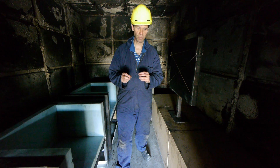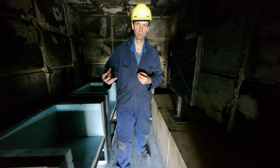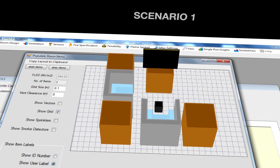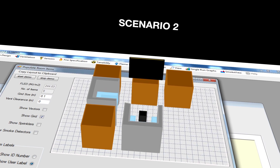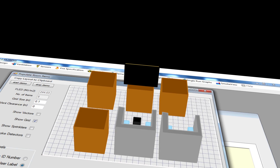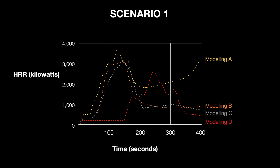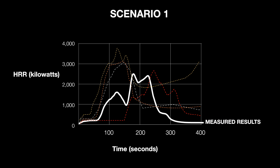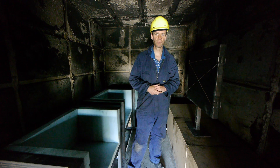We've gone through a process called blind modelling — we agreed on these layouts beforehand, then did the modelling, and now we're doing the experiments afterwards, trying different layouts and scenarios within the room. We run different iterations on our computer model, try out different parameters, and then compare the experimental results with the modelling results. The goal is to get a close match between the two so we can be confident the model has been validated and is suitable for practitioners doing fire safety design in buildings.